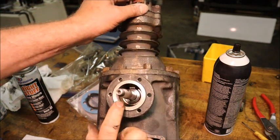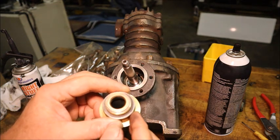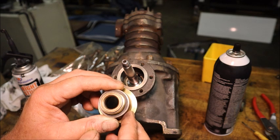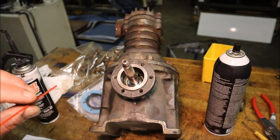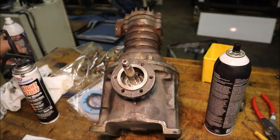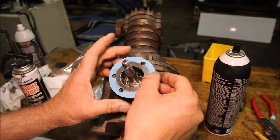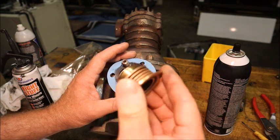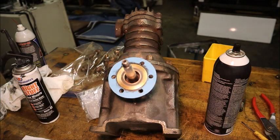Right around the shaft down in there there's a brightly polished ring — part of the shaft itself — that's the rotating face of the shaft seal. The face of this piece is lapped bronze, and that is the other stationary face. That depends on a film of oil, so I'm going to use this Lucas chain lube, which is a thick tacky oil — it'll stay put. Using it sparingly. That wasn't quite as sparingly as I wanted, but it won't hurt to ensure those seal faces are coated with oil. There's a gasket that goes behind it — I was careful not to get that oil on the gasket surface. Put it in there like so, and there's a stack-up of parts that goes on top of it.